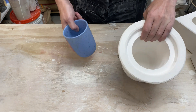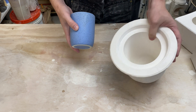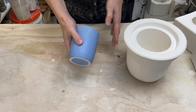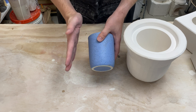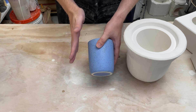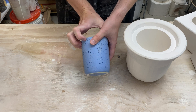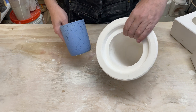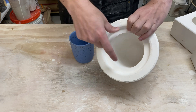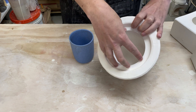In particular, I've been thinking about getting beyond one-piece molds. Here are the types of things we've been making recently — this is a one-piece mold and the resulting pot. We sketch the profile and all the 3D printed pieces are made, then we pour in the plaster and we can slip cast the pots. One defining characteristic is that they are one-piece, and to be a one-piece mold we need a draft angle on our design. This is actually slightly tapered in at the bottom, so the top is wider and we can pull it out of the mold. If any point in the middle were narrower, we'd wind up with an undercut and couldn't pull it out. That's directly reflected in the geometry of the mold itself — at the top the plaster hole is wider and at the bottom it's narrower, needed so we can get our pot out, and also so we can get our 3D printed mold out.